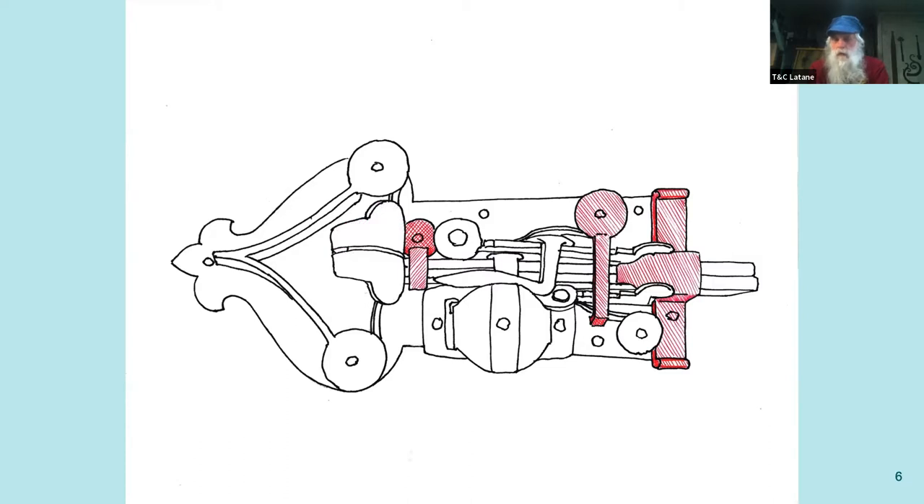Highlighted here are what's being called the rear staple on the left, a spring cover in the middle that has a retainer keeping the tumblers in line, and the front staple on the far right. This front staple has an added section in the middle believed to protect the fingers when you hold the tumblers open and close the door. Moving the bolts back, the fingers don't get hit by the lugs on the sides of the bolts, nor would they get pinched when the bolts go forward.